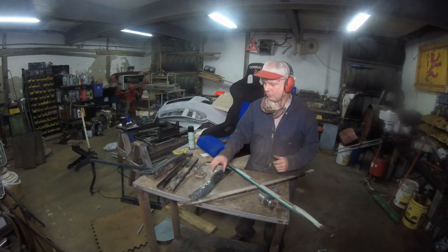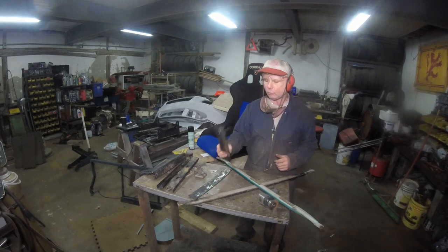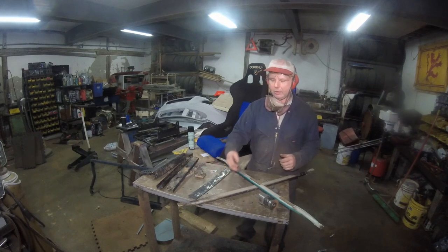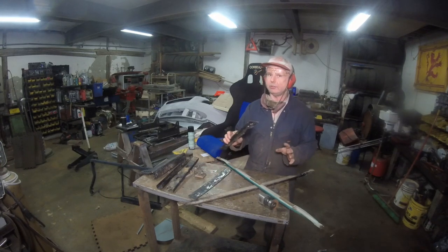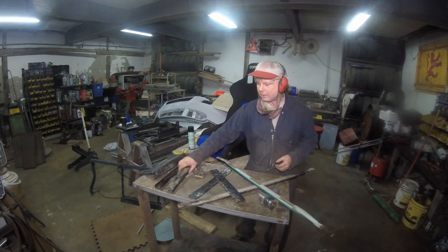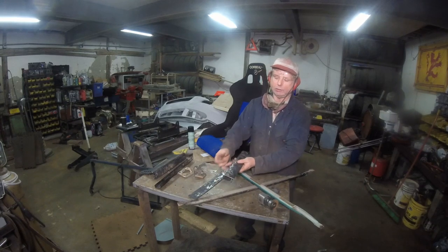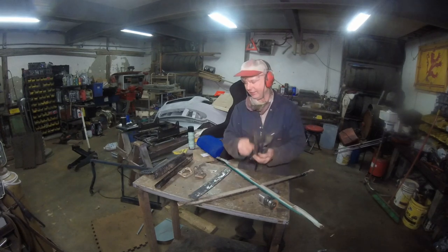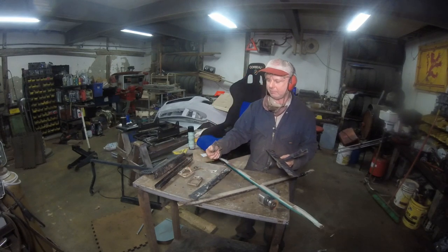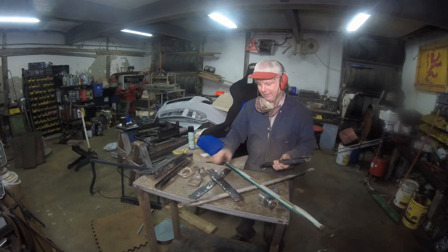Now, these are the plates that I cut up for the driver's seat. I'm going to reuse these because they actually go flat on here. They're pretty thin, but this is just to make it so it bolts on, and I can weld it. Then, in between, I am going to use a stiffening brace that goes underneath like that and weld it to the side. But I got to first weld in the capture nuts. The capture nuts are going to be these, more of the M8 bumper mounts. I really like using them, so that's pretty much it.